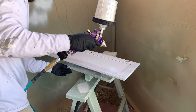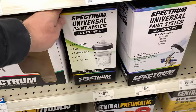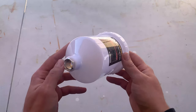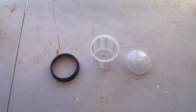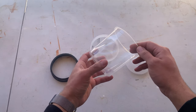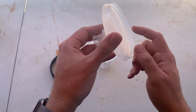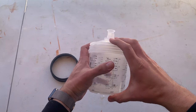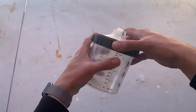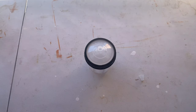This next piece of the setup is really what makes it for me — it's the same sort of setup I had at the cabinet shop, and when I found it at Harbor Freight I was thrilled. Throw away the cup that comes with this gun because it's garbage and you don't want to spend all your time cleaning it out. This starter kit has a cup with disposable liners and lids. It's even got a cap you can use to store leftover paint — I left some pre-catalyzed lacquer in it for three days and was able to use it again. The icing on the cake is that these lids come with a filter built-in that filters your paint as it's being fed into the gun. This eliminates the need to filter your paint before pouring it into the cup, and cleanup is much easier because you only clean the small section between the cup and the tip, then just throw away the liner and lid.